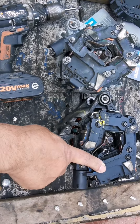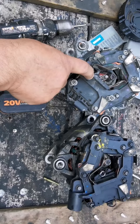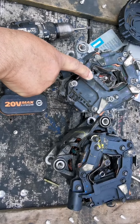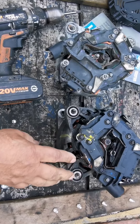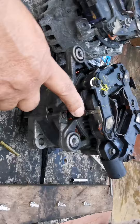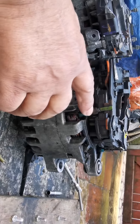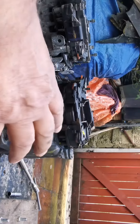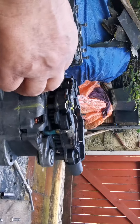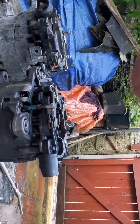This is the broken one, and this is the right one. What we're going to do is change this diode assembly into this broken one. We're going to take this off — it's got connections here, one connection here, another one here, another one here. We're going to grind these three parts off and then lift this off.